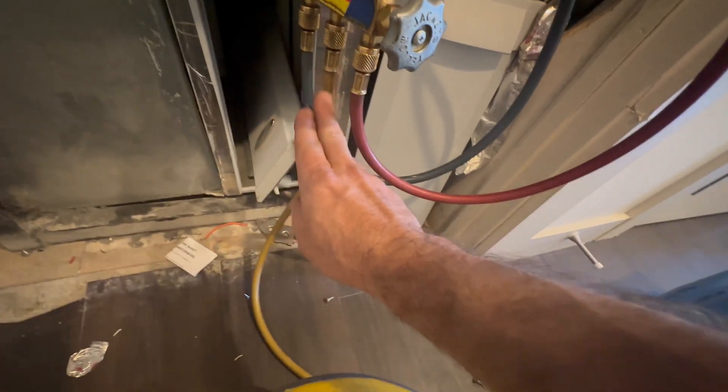At the end of the repair when I was charging the system, I was not able to dial in the charge because the cooling tower water coming into the heat pump was too hot — needs to be about 70-75°F, that's kind of the Goldilocks zone. I do know what the issue is but that's not getting fixed today. Why didn't I weigh in the charge? Because I'm an idiot and I left my scale at home. I haven't been doing a lot of refrigeration repairs so the scale is going to be in my car tonight. Another mistake: not changing out the seals on the hoses for a faster and deeper vacuum — those seals are bad and need to be changed out. It's one of those things I kept planning on doing but never did. I'll most likely be doing that tonight or tomorrow.